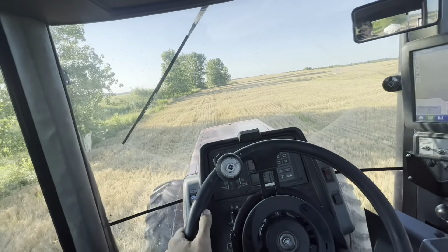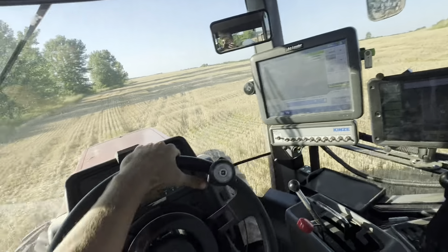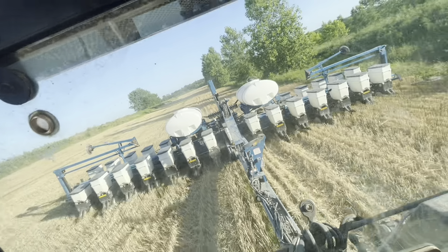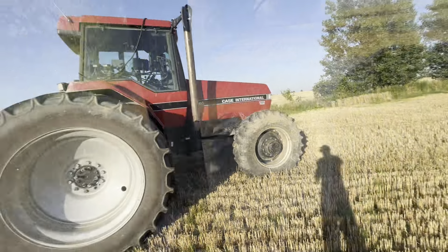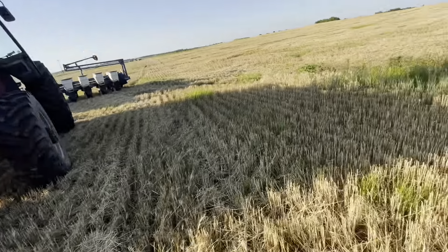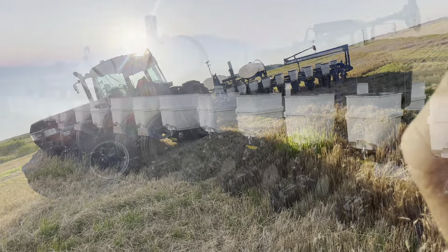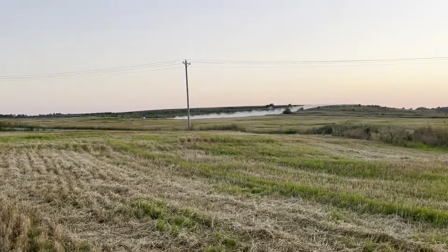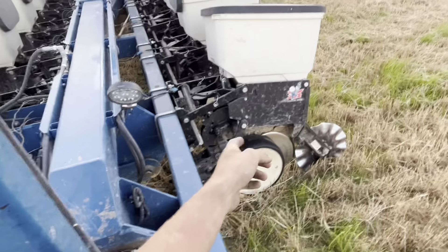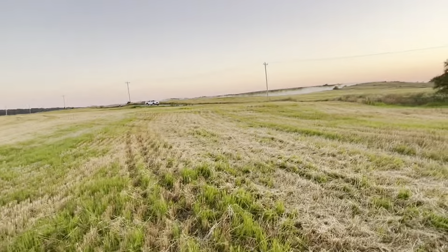The race is on — last time I'll pull the planter, hopefully this year. It's complaining a lot already — it's got a row that thinks it's not planting, but it is. Very annoying. We're double cropping, getting her done. Checked my depth and everything — all looks well. Let's send it. Planting pretty well — considering we're planting into concrete, it's consistently inconsistent. But it's working. Jake's coming with parts — I jacked up a row unit. Luckily I've got parts, but I broke a parallel arm so it's just sitting there flopping. Luckily I keep those on hand because that's not the first time I've done that.